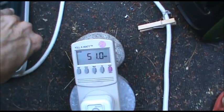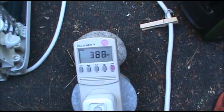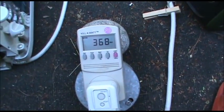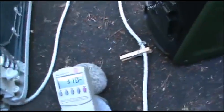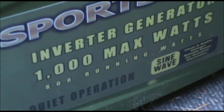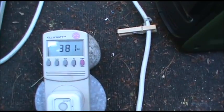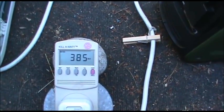Let's fire that compressor up and see what happens. At the absolute worst I'm seeing this air conditioner only pulling about 368 watts. A 400 watt Honda — I might plug into this just to see what happens. I'm really not sure why my Sportsman can't handle that, since it's a thousand watt max, 800 running watt generator. A little disappointed. It's sitting at 377, 378 — nowhere near 800 — and the startup was less than that. We might unhook this start capacitor and start it up one time just to see how much difference wattage this thing makes.